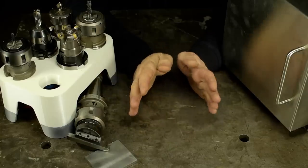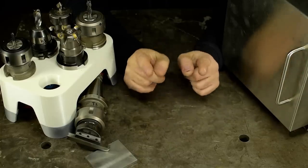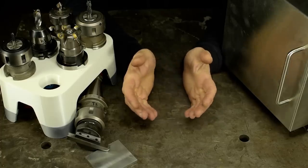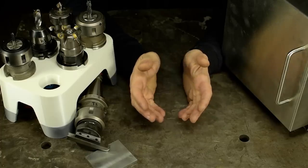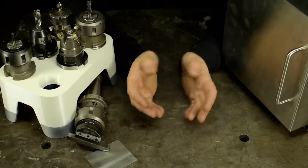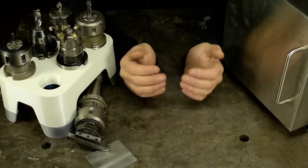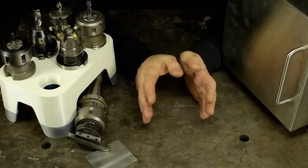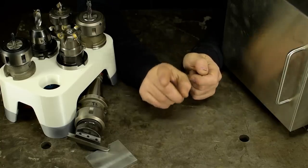Speaking of noble gases, they're only noble on paper. Be mindful of pumping your small garage full of inert gas, lest you wake up dead. If you start feeling drowsy, and you're anything like me, your first instinct might be to stop, drop, and roll. But don't. That's where the argon is.